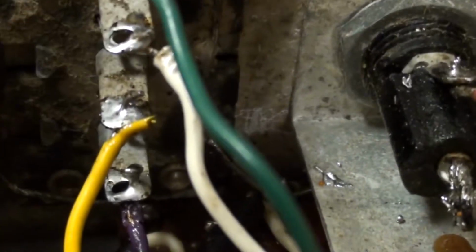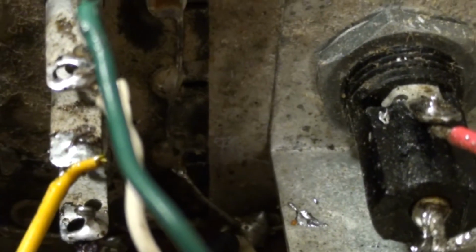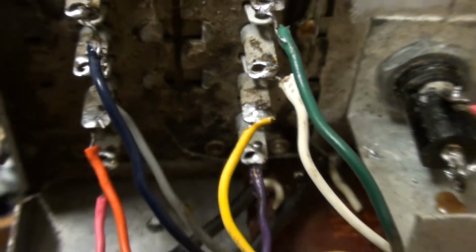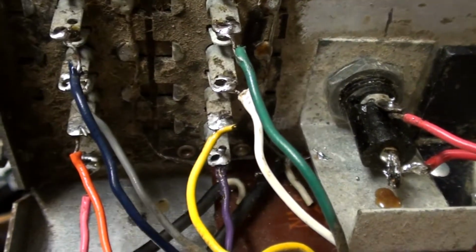Also, I touched up the two ends down here in these corners. One that's right there, and another one that's right there. I just bridged them with some solder. Hopefully it should be a strong enough connection for a ground for all of them. Because they're all linked together, they should be good for grounds. Not sure why they got it like that, but it's like that anyway.